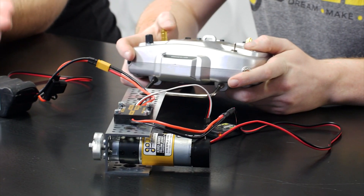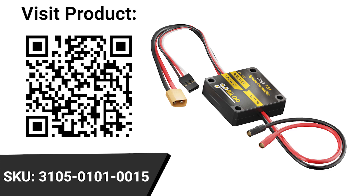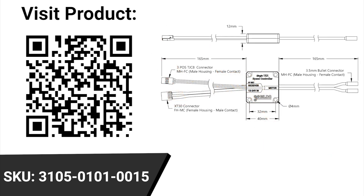You can see we can go very slowly and then quickly ramp up the speed. We're using one of the relatively new speed controllers on our site — the Gobilda single channel motor controller. It's worth noting that when you're using a proper speed controller, while it does reduce the average voltage, it has more torque than reducing the actual voltage with a rheostat or variable resistor. It's using the full voltage in tiny pulses, so it's like hitting it with a hammer — you get pretty near as much torque as if you were just plugging it directly into the battery. The other thing you get with a motor controller generally is what's commonly referred to as brake mode.